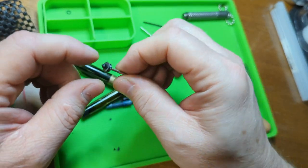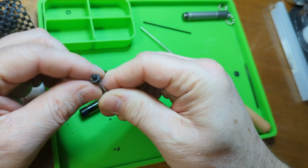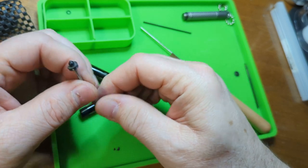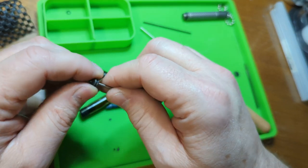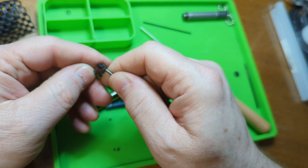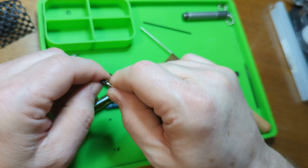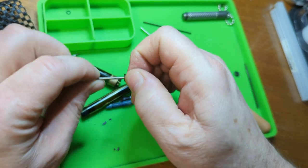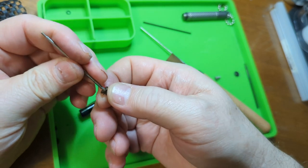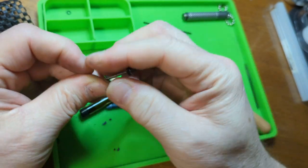So what we're going to have to do is, now that we have the rod that will work, we have to get this apart so we can put a new seal on it. We also need to knock the feed out of this section. Normally the way you do this is you need to heat this up because this is a piece of ebonite, and ebonite when it gets heated up will come apart. I've had issues getting these ones apart in the past.